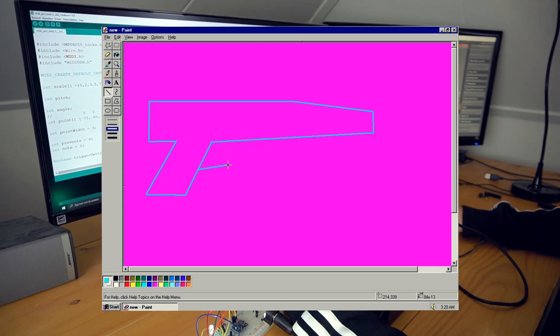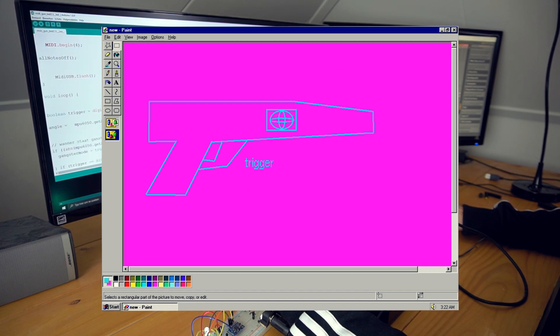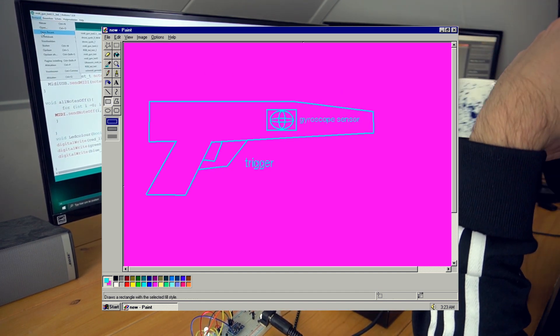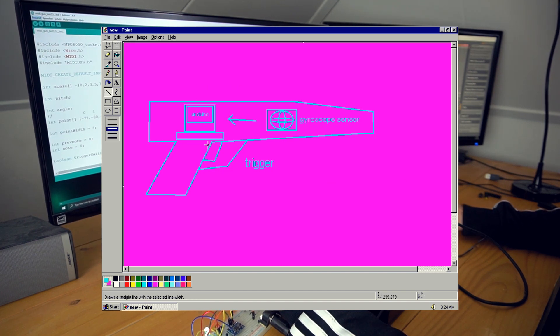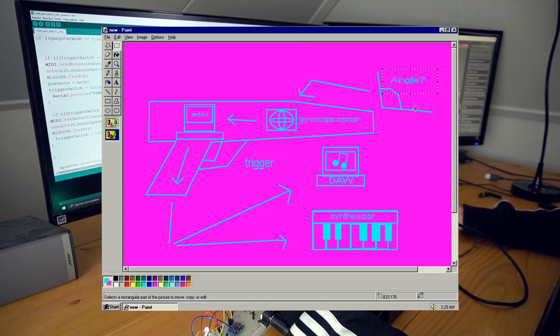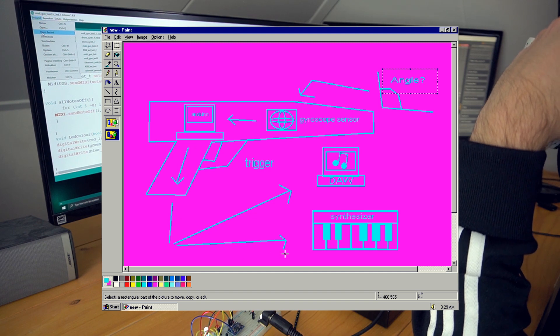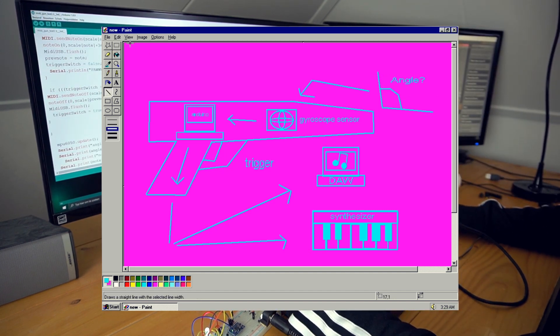Let me explain what I'm going to do today with another Epic MS Paint video fragment. I will open up the Nintendo Zapper and take all of the electronics out. The only thing I will be reusing is the trigger. If there is enough room in the case, I will install a gyroscope sensor, which can measure the angle of the object. My goal is to convert that information into something a synthesizer or music program can understand. I'll be using an Arduino to convert that information. When I press the trigger, the Zapper will generate a higher or lower tone depending on its angle, then send a MIDI message to a synthesizer or musical program which will generate the sound.